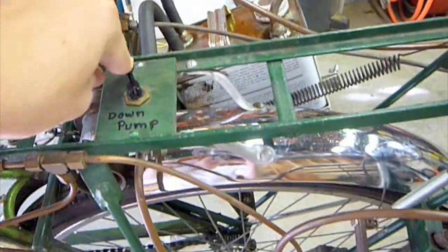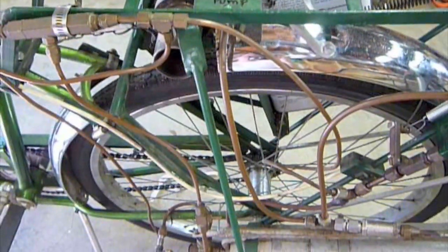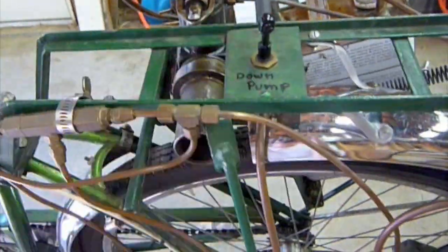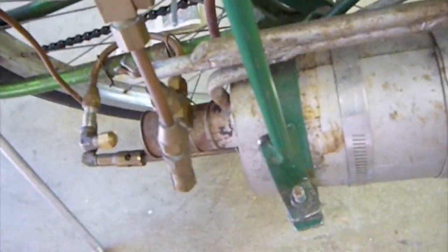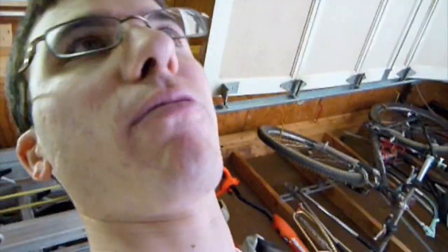When you close the bypass up here, it pushes cool water into the boiler, which cools it off, which starts up the burner again. If you leave it open, it's not admitting cool water to the boiler, so the boiler stops making steam because it's already up to temperature. This is quite ingenious — and actually the opposite of what a fire tube boiler does, because in a fire tube boiler, putting more water in usually cools off the boiler, which is sort of frustrating.